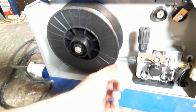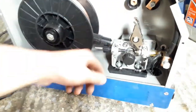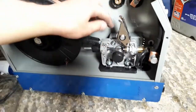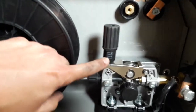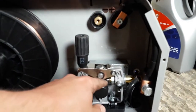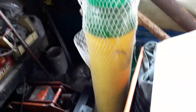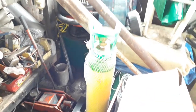There's just a little spool that goes in there. What you do is you feed it through just here and this bit just clips off. So you feed your wire through there, pull that down and then you just set it so you don't want it to crush the wire but you need it just to grip it so it feeds through. And then I've just got a small gas bottle which is good enough for what I need - I don't need a massive bottle.